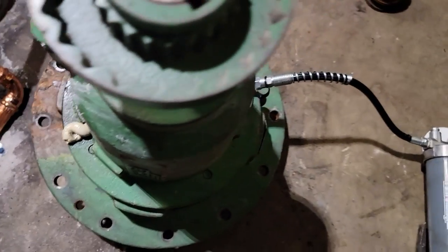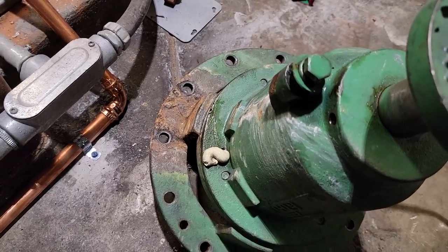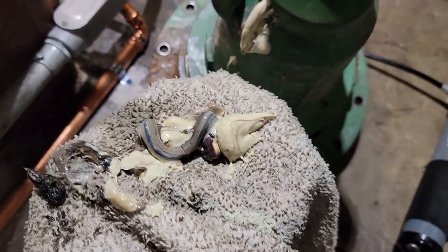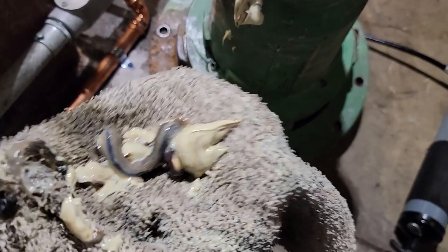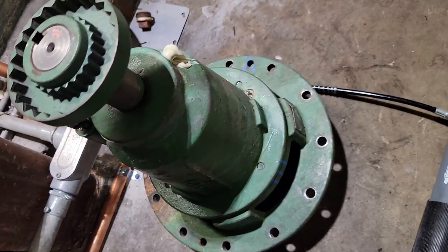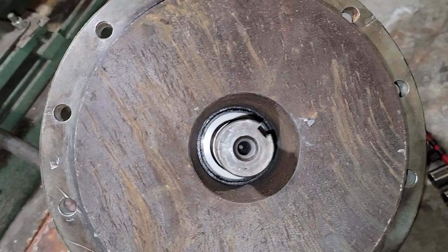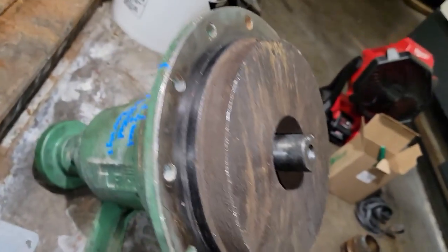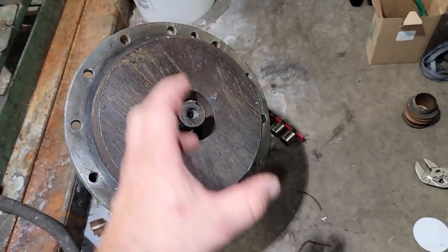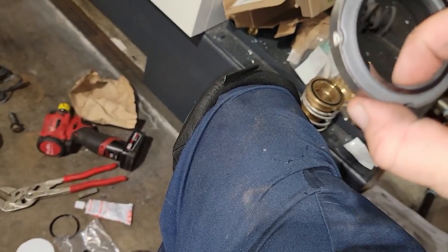We're going to spin this thing some more and get it all out so you aren't packed full of pressure. We flushed through it — the bearings hadn't been getting greased very often prior to us. It's lived a hard life. The top one looks like some really nasty crap came out of there. You're really not supposed to use different motor greases. I put my ear up against the body and was listening for it, because I've had a job where everything seemed fine, got it together, then found out the bearings had a whine to it.